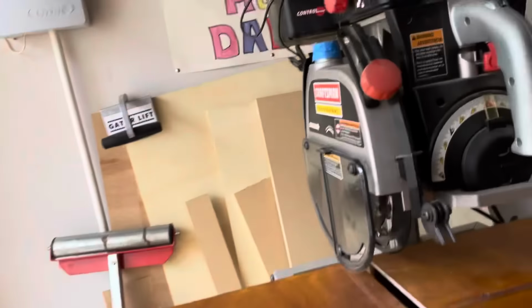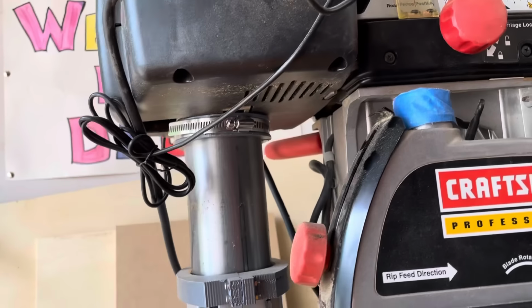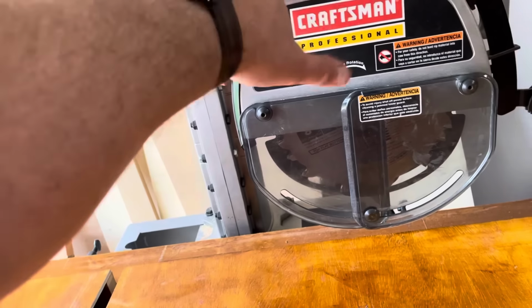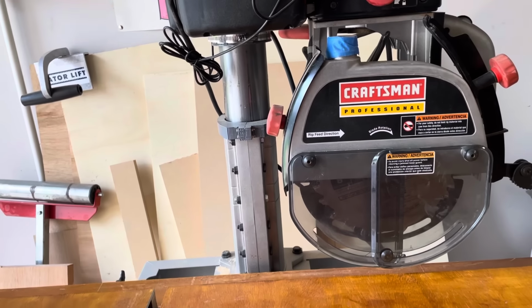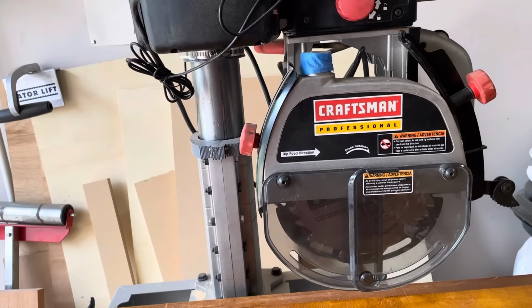On top of it, if you take a look at this saw, I'm just swinging the arm back on that. If I take a look at this saw, it's probably another 6 inches out from the post. So when you get it really out on the arm, that arm has a fair amount of weight, so it can kind of lift up a little bit. Now, if you come back down the cut, it should kind of level out, so it doesn't cause as many inaccuracies.